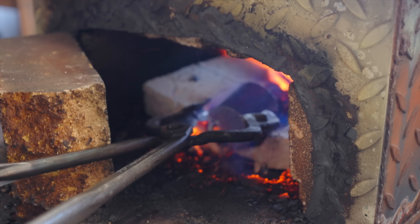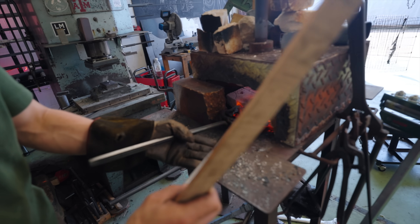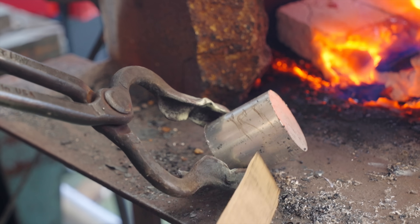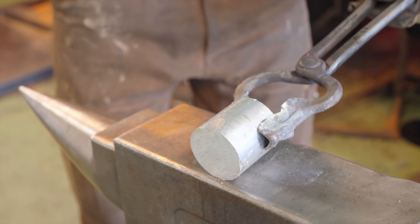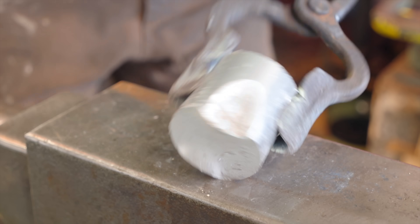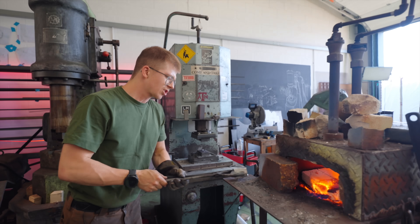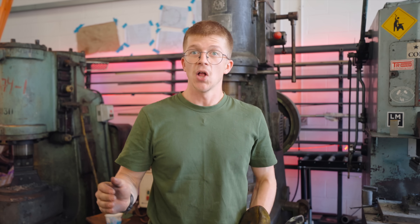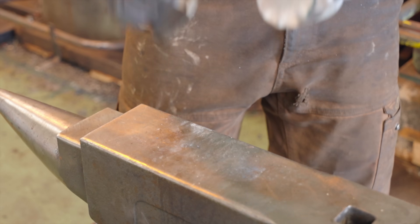Here's a trick for working out if aluminium's hot enough to forge — take a bit of wood. When it chars, that tells you it's hot enough. Forging aluminium is kind of like this — you can hear how it sounds, it just sounds soft. It doesn't bounce around on the anvil and it deforms really, really nicely. So I expected magnesium to forge similarly to aluminium because in my simple brain they have a similar visual appearance and they're both quite light metals. Back to the magnesium — it feels barely any different to how it felt at room temperature.